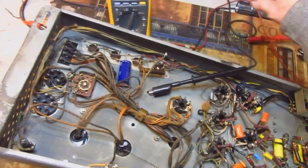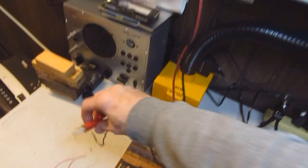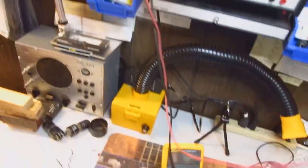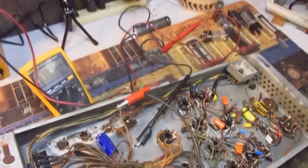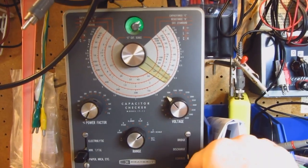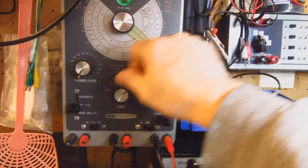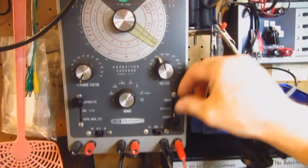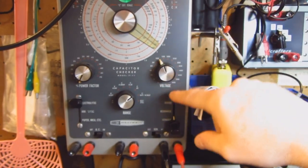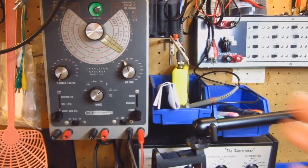So we'll take this off and put high voltage to it. In this case the leakage is so severe you don't even have to put high voltage to it — we'll start out at 50 volts and it'll probably show that. I'm not even on the sensitive setting; I'm on the intermediate sensitivity for leakage. We have our test set up. I clicked it up to 100 and we're already showing leakage — it's already shocked it to the point where you got that. Even flicking it up to the electrolytic setting, we're testing full hardcore leakage. This is the true test on something like this. You should be able to fire this up all the way from the paper mica setting up to 600 volts and you should get nothing — it should be completely open.